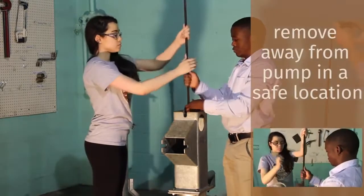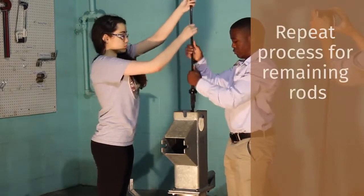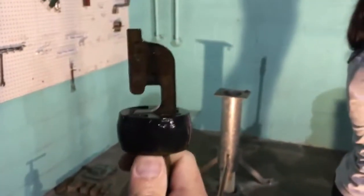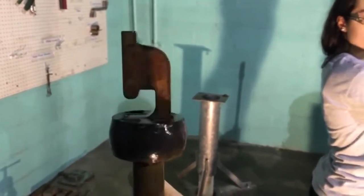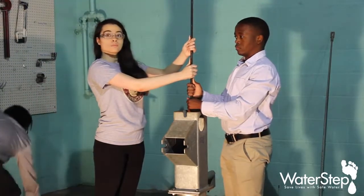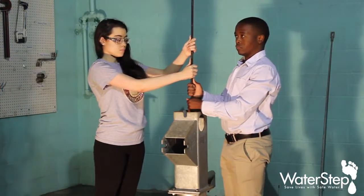You repeat this process for as many sucker rods as there are, and there may be anywhere from five to fifteen of these depending upon the depth of the well. The little rubber device there actually serves two purposes: it keeps the sucker rods centered in your rising main and keeps them from rubbing against the side. Also, when you connect the sucker rods together you can pull that down so that it locks the two together, so it's really kind of a dual purpose. Some of these are missing — that does not really keep the pump from functioning well, but if you've got them it's a good idea to replace them as you're working on the pump.